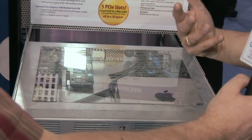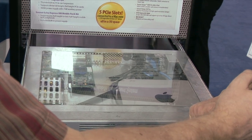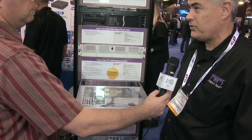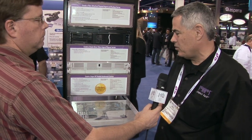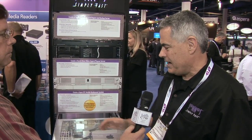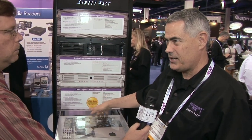It's adapted for most cards used in the audio industry. Thunderbolt-compatible cards include Universal Audio UAD — Solo, Duo, Octo, Quadro. The Lynx AES16 cards: it holds two of those so you can get 96 channels at 48K off a Mac Mini. It also holds the RME MADI FX card, and we have a special mount kit for the daughter card so you can get all three MADI connections out for 128 channels at 96K.